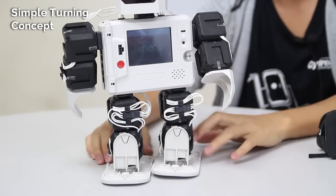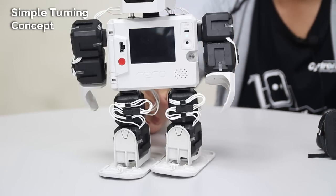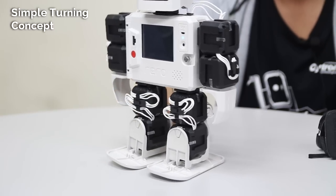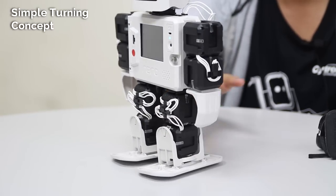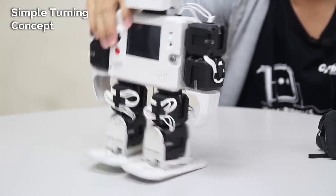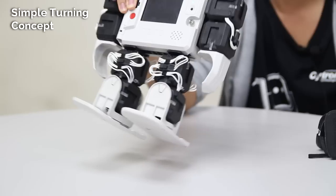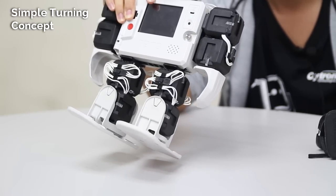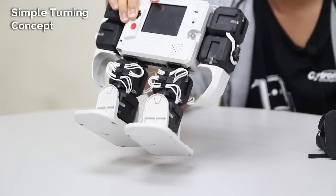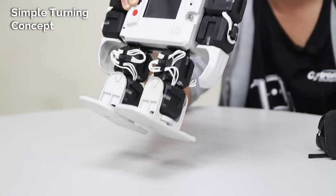If you apply the same concept, you can make the dwarf robot turn left or turn right. This is the turning sequence. Other than shifting forward, it's actually shifting to the right. The program is also very similar — in one frame only the leg servo moves, and in the other frame only the ankle servo moves. The main difference is that the ankle servos still shift left and right just like when the robot is walking, to balance the body.